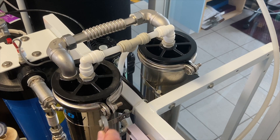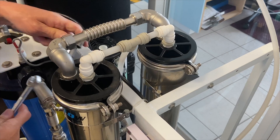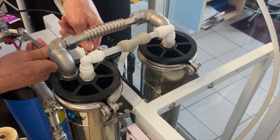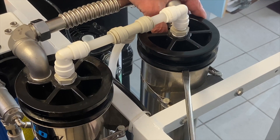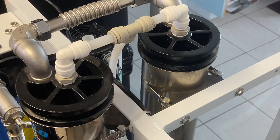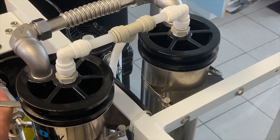For this particular one I found the bolts on this side were 14 millimeters and the nuts on the other side were 13. Just loosen them up — as always, lefty loosey righty tighty. If yours are stuck like these ones, you can see there's a small gap on the cap. Insert a screwdriver in there and carefully pry the caps off, going around all sides and applying equal pressure to rock those caps and get them off.